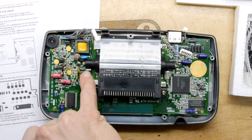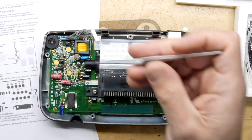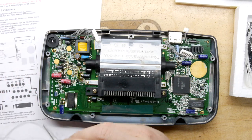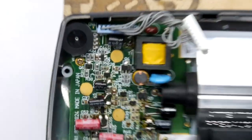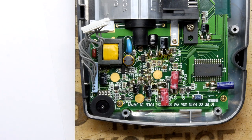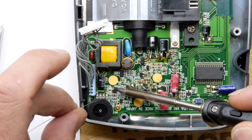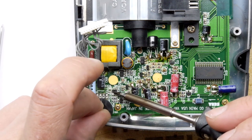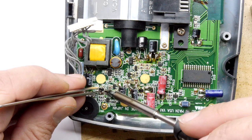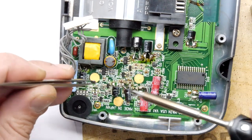You can see these are the capacitors I would have added before just to get this thing working. Looking at the instructions, I need a poking device - it says to remove R33, R34, R30, R32, R29, and those are dotted around here. You can see them written right there. Time to get the soldering iron warmed up. I'm not using a hot air blower as I don't have it with me, so just normal soldering iron technique - applying plenty of solder, and if you've got flux it works even better. For this transistor, I'm heating the single pin first because it's on its own, then getting the other two.